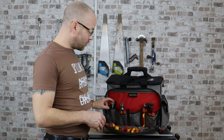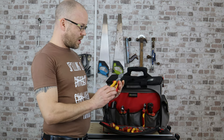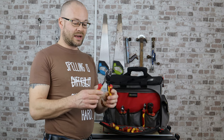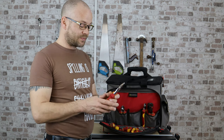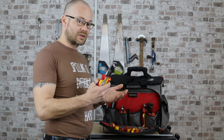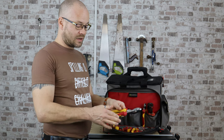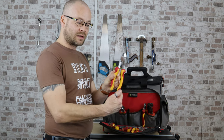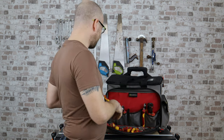On the other side, I've got my proper snips — my wire snips. These things are great. They'll cut anything up to 6mm quite easily. They will do 10mm but you have to do it in chunks. These are also spring-loaded, so if you're doing repetitive work, like changing a consumer unit for example, just flip the spring over and it automatically springs back open for you. Very useful tool to have.